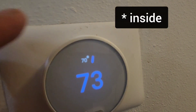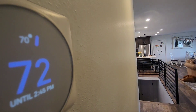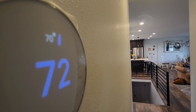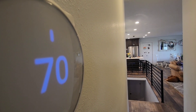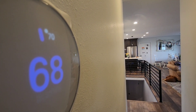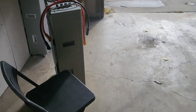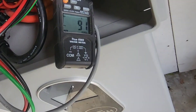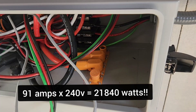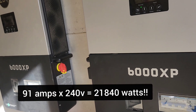Right now we are 70 degrees outside. Let's just turn this down so the air conditioner comes on. Here are the lights — this is just with the one wall-mount battery right now. You can see that — just slightly, just a very slight dim. It doesn't really bother me. 91 amps inrush — that is over 21,000 watts of inrush to start that air conditioner.